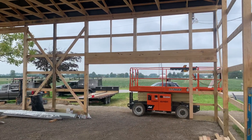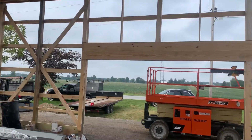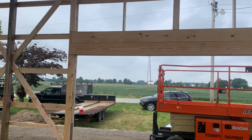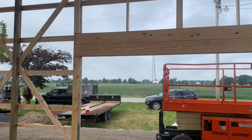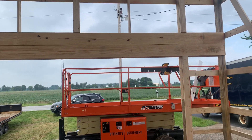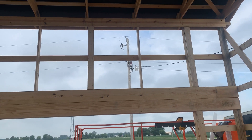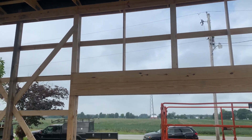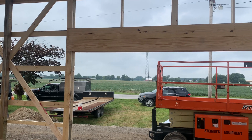There are different ways to do this. You can do an LVL — what we did here on this 16-foot span is 2 by 12s. You can see how we did a double top beam right there. Now you've got your header supporting the truss up there — the truss is 2 by 10.